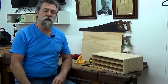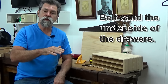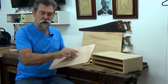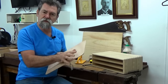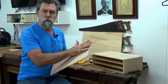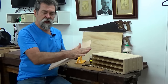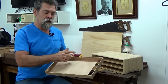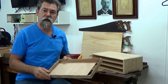Belt sand the underside of the box but don't go through the plywood finish — don't go through the last laminated ply because it's only very thin, normally a veneer on top of the more structural base underneath. So careful, but take off any lip that's sitting proud above the plywood and get rid of that.